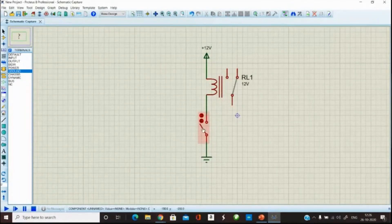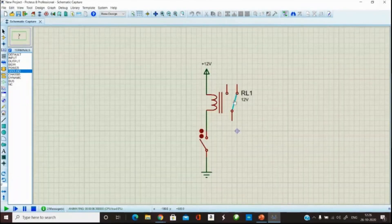When the relay is on, see the other side — this is normally in an open state. When I close this side, watch the contact moving. Why is the contact moving? Because the coil is activated, because current starts to flow. When I open this switch, that contact also opens. So that is how we make contact with the relay. On this side, we connect the load.